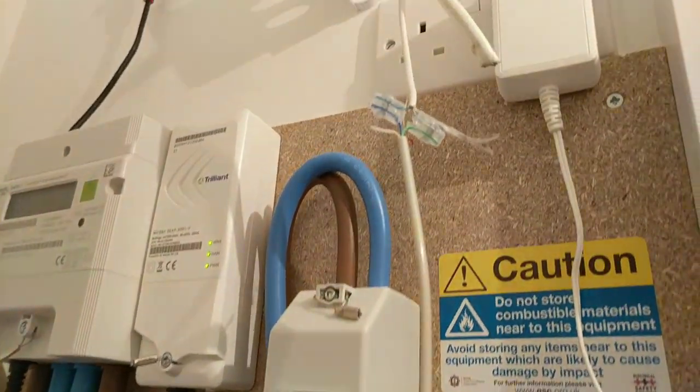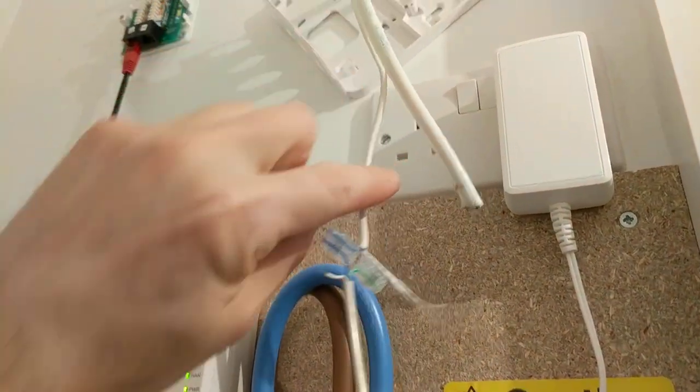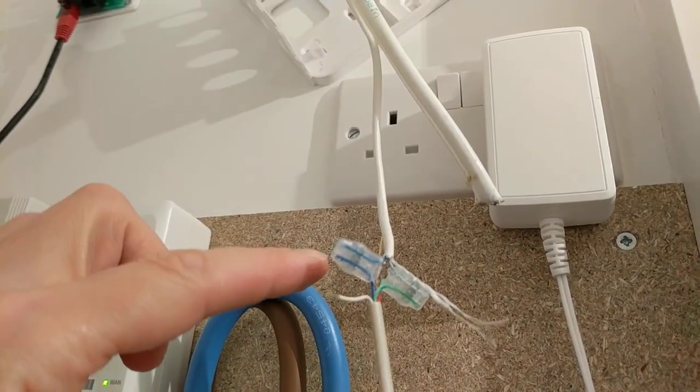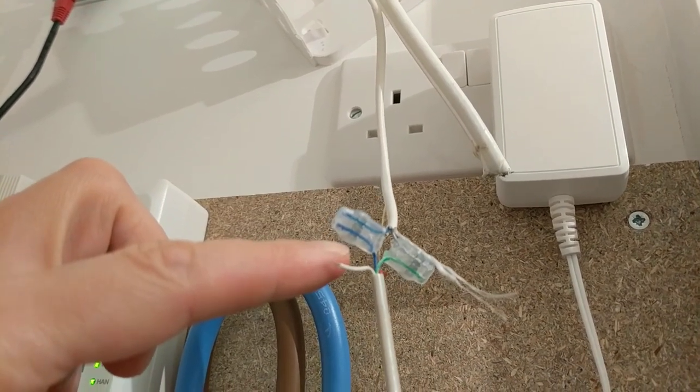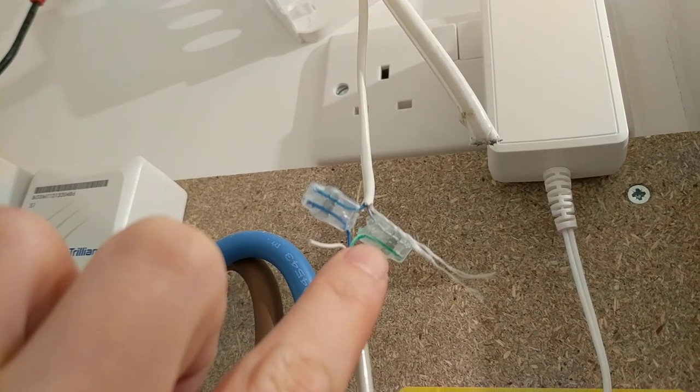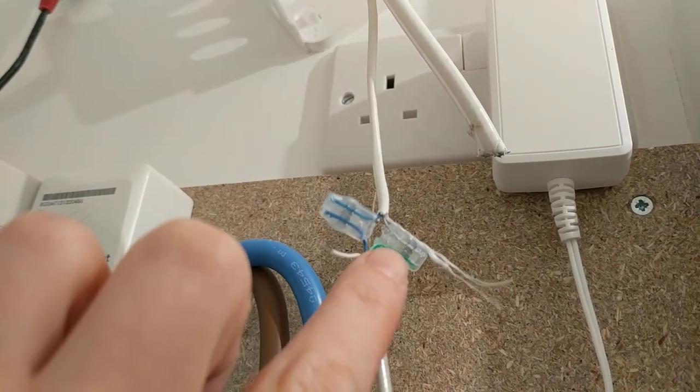In this apartment the only wiring I have is this two wire Virgin Media cabling that I happened to find. I've taken the blue wire and extended that through to connector number two on my phone extension socket, and the green wire I've extended through to connector number five.